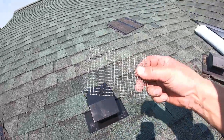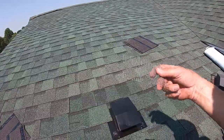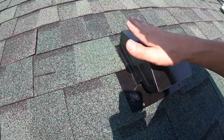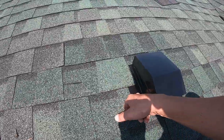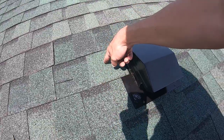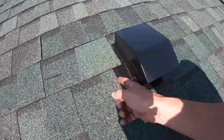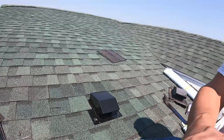Side note on these screens: if you use this for a dryer, I would never recommend it — make sure you pull this screen out because it's going to catch the lint and clog it up. There is a trade-off of how far or how low you tuck your shingle. I could have put this one on top, but the trade-off is the amount of distance where water jumps off onto your roof deck versus the amount that could run laterally under here. That's my two cents.